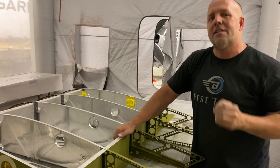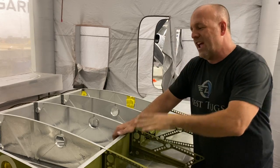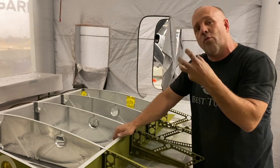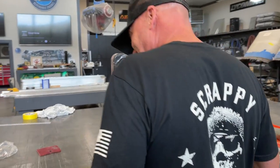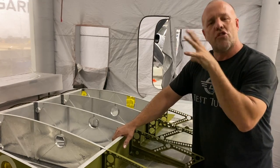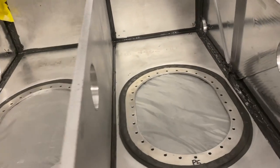Now, you have to really, really prep the tank well, because they have had Citations literally have complete flameouts where the tank sealer, after several years, started coming off. The thin coat tank sealer started coming off the walls. It would go down and it would clog all your fuel filters. So if you're going to do the next layer of tank sealer, you need to make sure you really, really prep it well, and make sure that you can open up your tank and inspect for any type of corrosion anywhere. Any tank that might have low spots that could have water traps that won't sump out with your water sump becomes a more critical area.